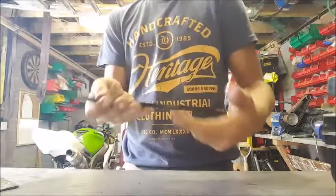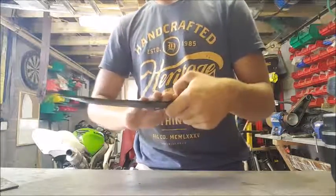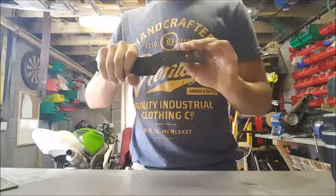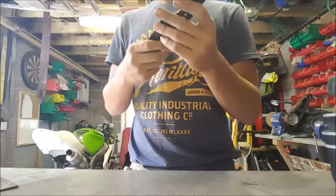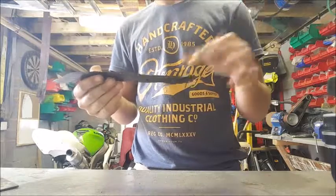You know, I could have very easily just done this with stock removal, and that's not really what I wanted to show. You know, I want to remember it's forged. So we'll leave that nice forged finish on there. We'll just take down some of the oil and that which is on there, which will be good. And yeah, we'll just clean up all the spine, the belly, the inside bit of the handle. And then we'll have to get to putting its final edge thickness on and then sharpening it up. And then we have a good knife.